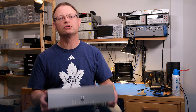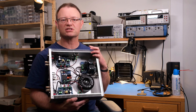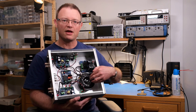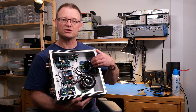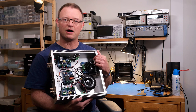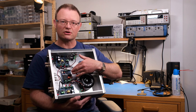Hi, I am Tom Christensen of Neurochrome. In this build video, I will show you how to build one of these Neurochrome Modulus 86 composite power amplifiers. The Neurochrome Modulus 86 provides 40 watts into 8 ohms and 65 watts into 4 ohms. This particular build is made with a 200VA toroidal power transformer that provides two windings of 22 volts AC to the Neurochrome Power 86. At the Power 86, it is rectified and smoothed into plus/minus 30 volts DC, which powers the two Neurochrome Modulus 86 power amplifiers. Speaker protection is provided by the Neurochrome Guardian 86, and the whole thing is controlled by the Neurochrome Intelligent Soft Start.